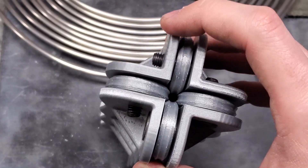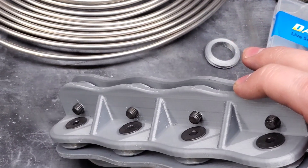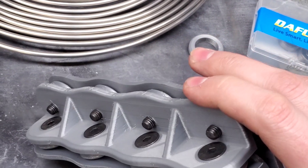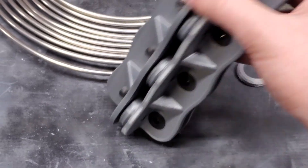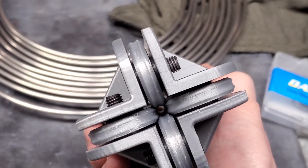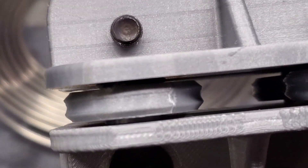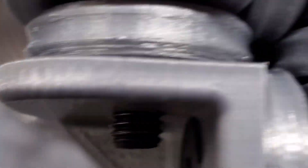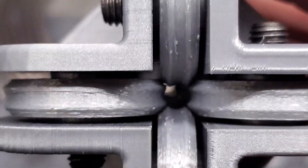So there are 16 bearings and wheels altogether. It's made up of just four of these brackets — all four of them are the same. One side just has a tapped hole and the other side just has a countersunk hole. Just got it all assembled, and there are some little shim washers that we 3D printed to space it out from the bearings so that they turn freely.